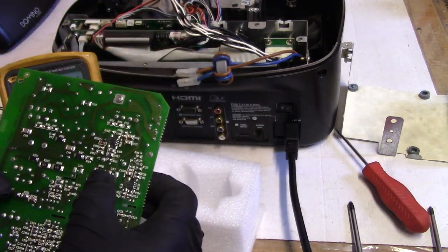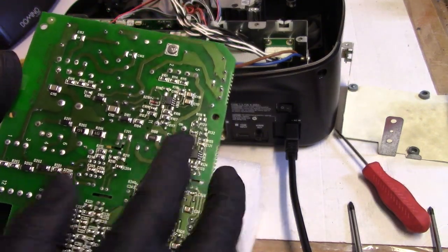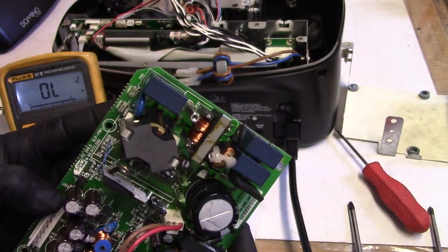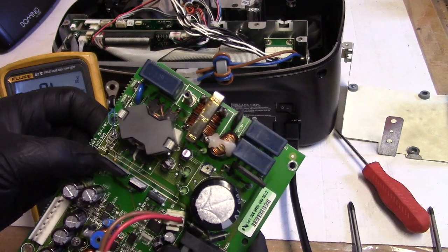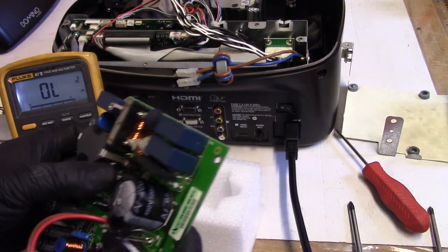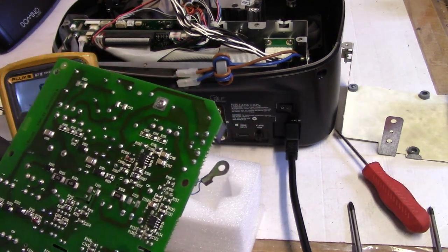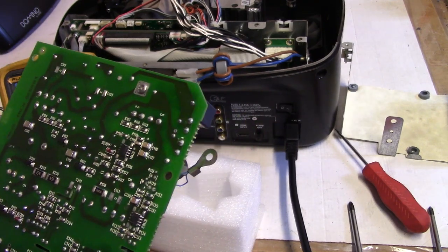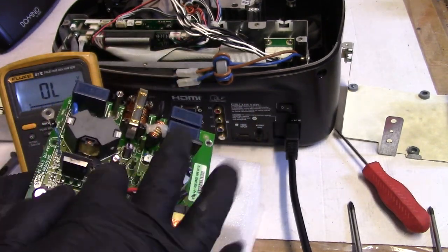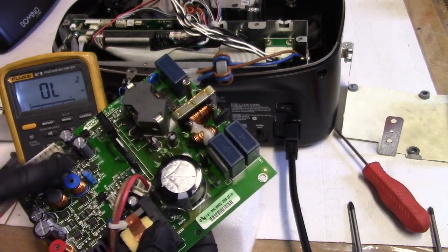Looking at this right, see, that's base. Yeah, that's base. And it is connected to... see, it goes back. See the trace going over to here, maybe? It's probably that chip driving it. But there's something else going on here. I think we might want to desolder that MOSFET and check it. This other one here, I'm pretty sure that's the low voltage switching for this stuff.